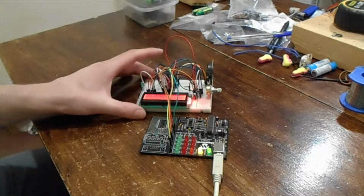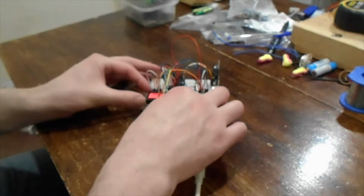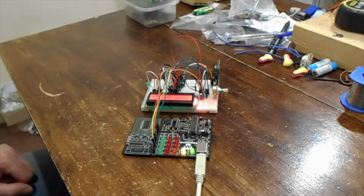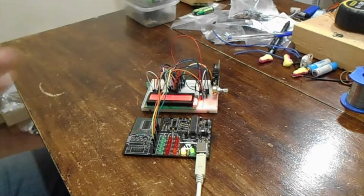And this little chip on here, this little beauty buried away at the back there, where my finger's wobbling around, is a baseline flash PIC16F54. If you don't know what baseline flash are, they're the real simple range of chips. If you've got a dead simple application that doesn't require massive amounts of code, or particularly sophisticated chips with various software and hardware functions on them, it's just for if you want a good chunk of in-out ports, the bigger ones are anyway, and if you want some real simple code.